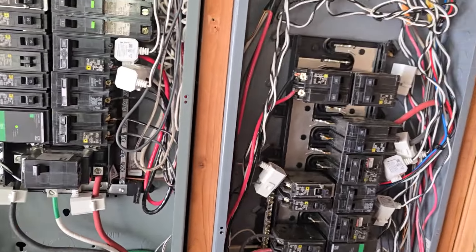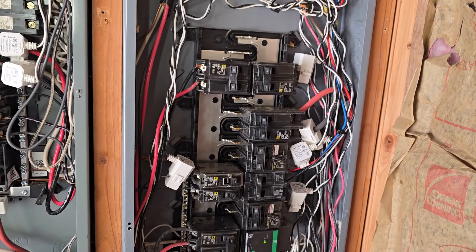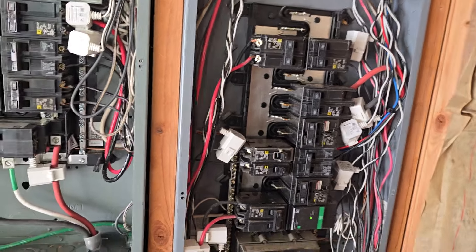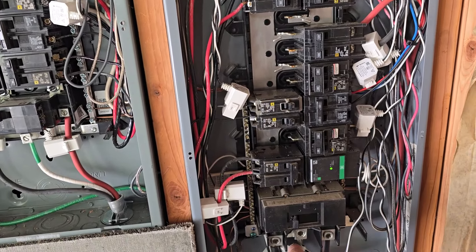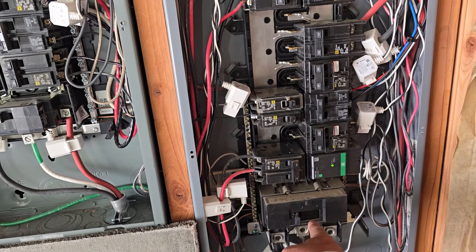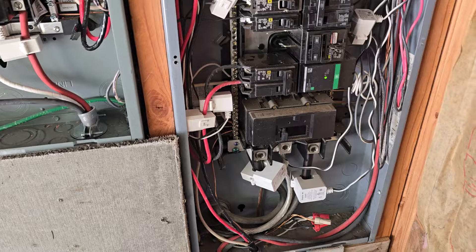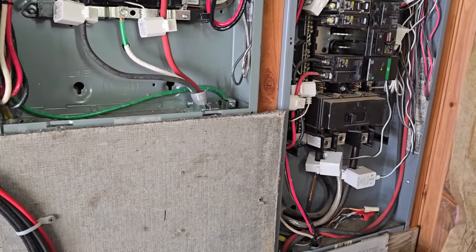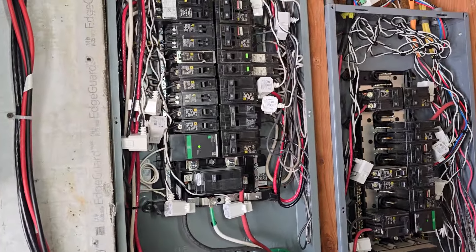When you do this, shut off all the power — running wires through here is very, very dangerous. If you don't feel comfortable working with power, don't do it. Even if you turn off the breaker and all the solar stuff, those two lugs coming from commercial power are still hot. Don't mess with them. Shut off all your power as much as you can and be very careful.